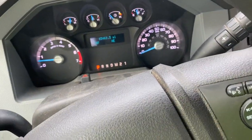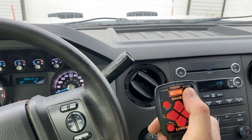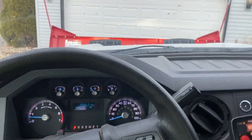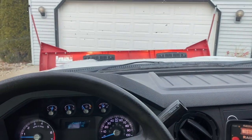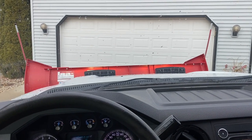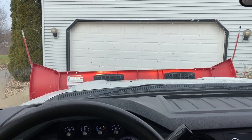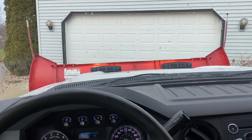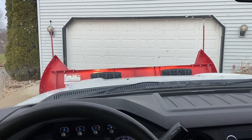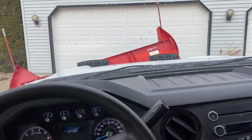Here's the controller. This is on/off — that's off, this is on. We're going to raise the plow. This is a very heavy plow; it'll actually lift above those headlights, so I cannot drive down the road like this. It's eight feet wide right now. I can scoop it — bring the wings out on both sides — and if I go back just a hair that's going to be ten feet, so I have a ten-foot straight blade. And then I can scoop it so both wings are angled, and I can actually turn it and go around corners either way.